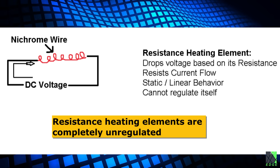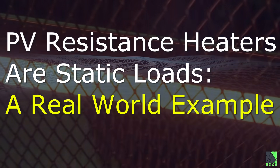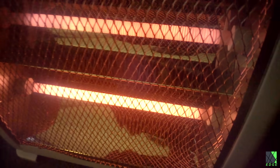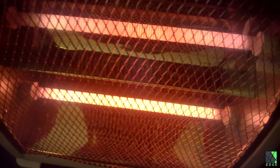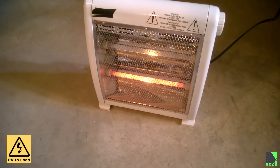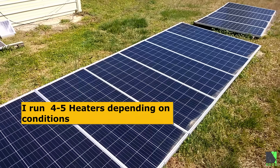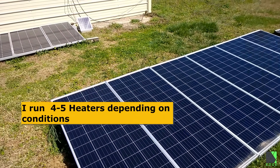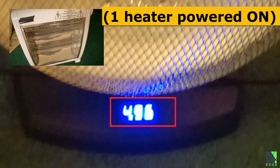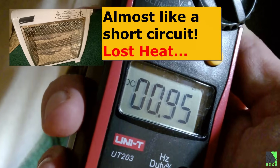You would need an MPPT DC converter circuit for that. Here's a great real-world example of why electric resistance heaters just don't work very well under varying conditions. This is one of my earliest 50 volts DC PV-to-load solar electric space heater prototypes. It sees heavy use during the winter season. The heater is connected directly to several large solar panels out in my yard, through a circuit breaker, it has tip-over protection, and so forth. As you can see, the voltage at this time in the morning is only about 4.96 volts, and the amount of current flowing is about 0.9 amps.